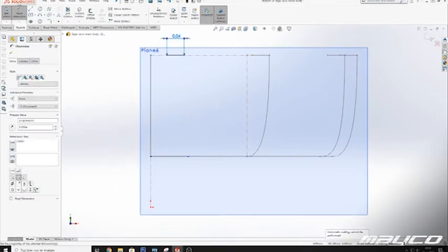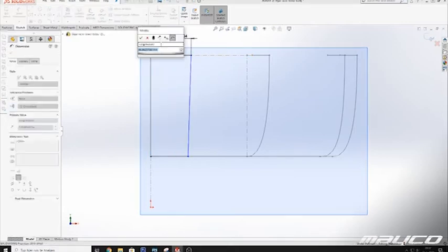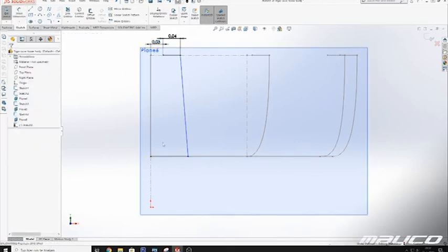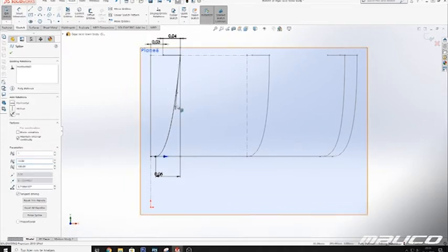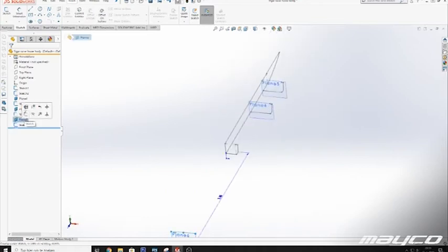So what you see me do here is basically designing the backbone sketches, so several intersections with the sketch, and basically the next step is to make the guiding sketches. These are the sketches that connect these first plane-drawn sketches to each other, and ensure that I can mold the surface into the position I want it to go.